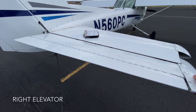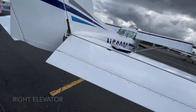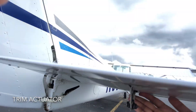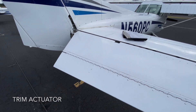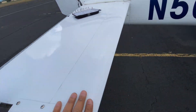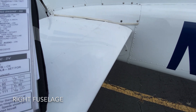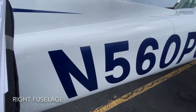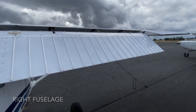Check the right elevator — the important thing here is that this is the one with the trim tab. That's the bar for the trim tab; make sure it's not moving too far. Don't handle the trim tab too much as it's a very sensitive area, as is the rudder trim, which is the flap of metal we saw earlier. Continue checking the tail surfaces over the right side.